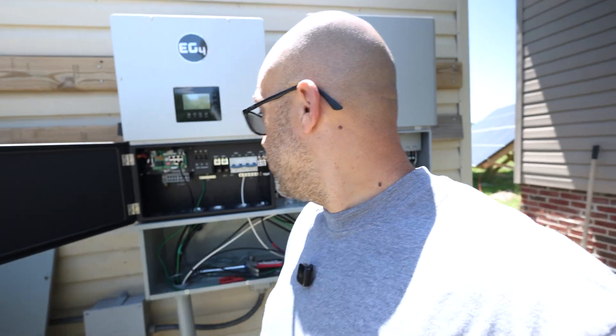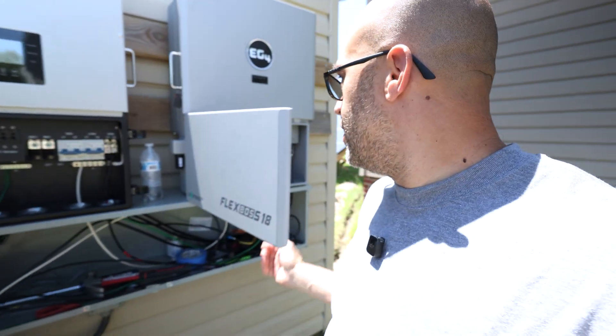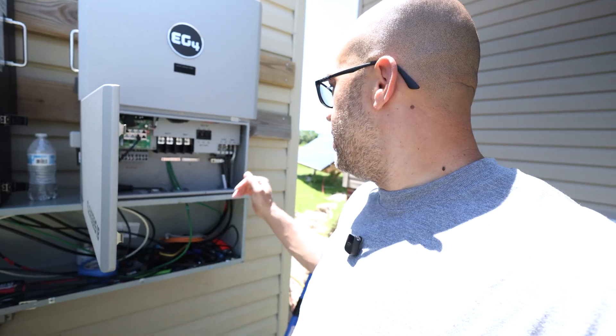With the lubricant, me and my son did it in about 10 or 15 minutes. Definitely well worth it — use that if you've got more than two 90-degree bends. I had three 90s in this conduit, which made it pretty hard. It got about 10 feet past the second 90 and just didn't want to go. I had like eight or nine wires, so it wasn't going to be the easiest thing to pull.